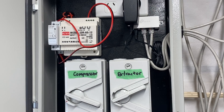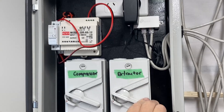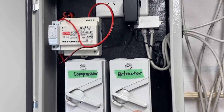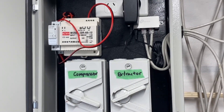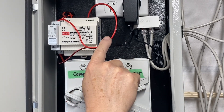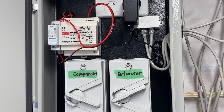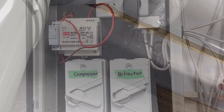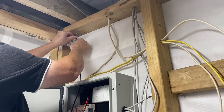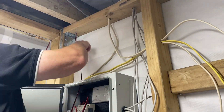I've put some temporary labels on these switches here so let's give it a go. Well that runs pretty good and I turn it off with that switch. Now this little temporary wire here will be taken off and there will be a wire that goes out to all of the blast gates, that will come in through here and be connected up. I need to drill a hole in the wall up here so that I can feed the wires through — they go through the cabinet through these holes in the wall and poke out the other side where all the blast gates are.